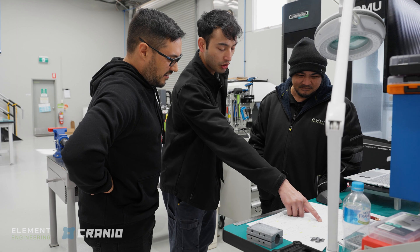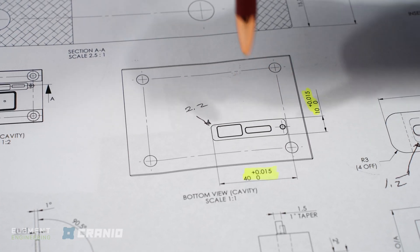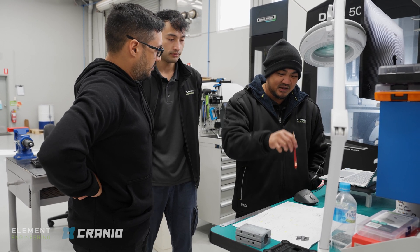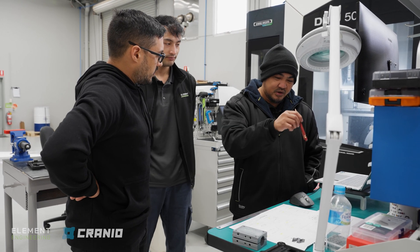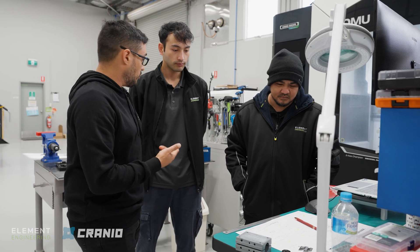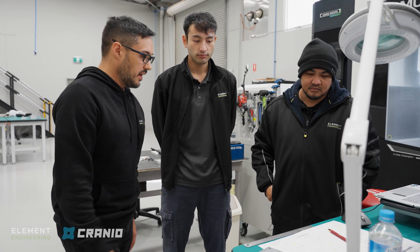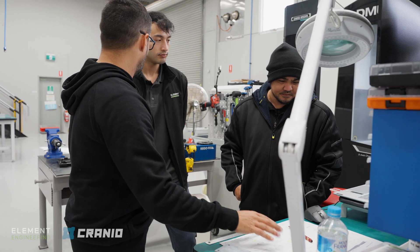You made a good point about adding an extra 0.2mm internal corner radius for the tool pass. Could you explain what you meant by that? For example on this it's exactly 2mm so we're going to use a diameter 2mm end mill for it. The tool will just go straight into the corner, but if you make it a little bit bigger the tool will go in a contiguous path — that avoids tool breakage. You've got all the tolerances highlighted here. You've specified a transitional fit so we should be able to put these things together with minimal effort, maybe a small amount of heating or cooling on one part. We're thinking we might epoxy or compound these together with a high temperature compound.